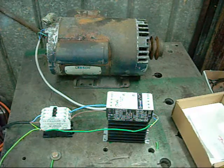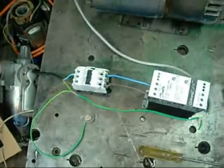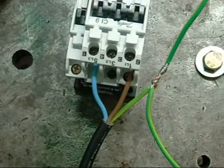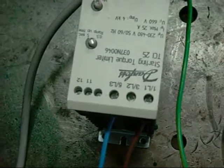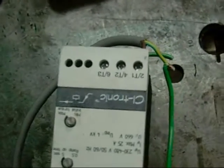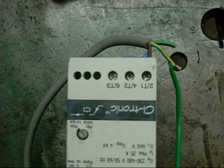That is how you can wire a Danfoss starting torque limiter TCL 25 or TCL 15 to a single phase supply. Starting from the AC in end, going L1 and L3 through the contactor T1 and T3, up to L1 and L3 on the torque limiter, and then out to T1 and T3. Completely ignore the second phase — L2 or T2 — on single phase applications.